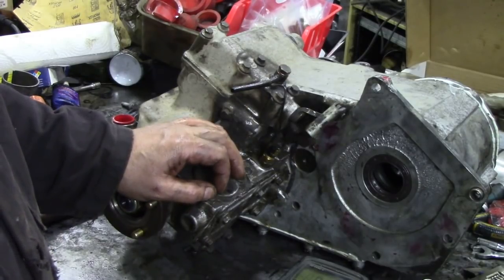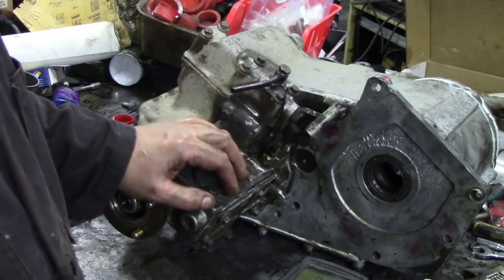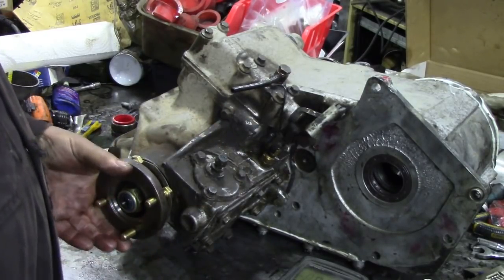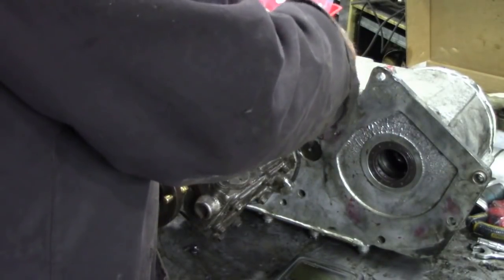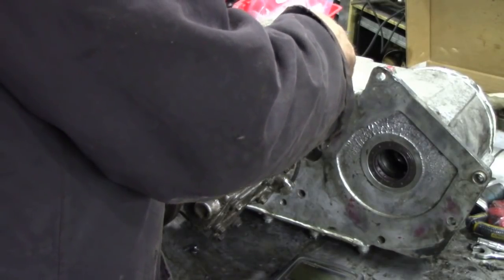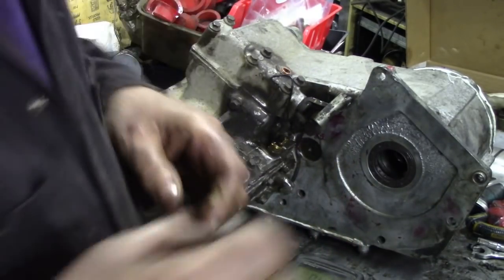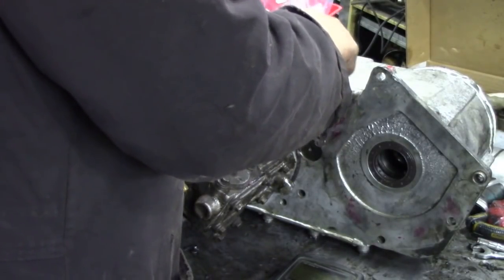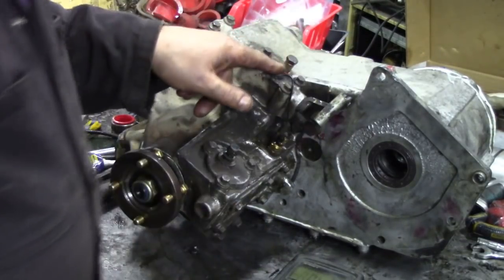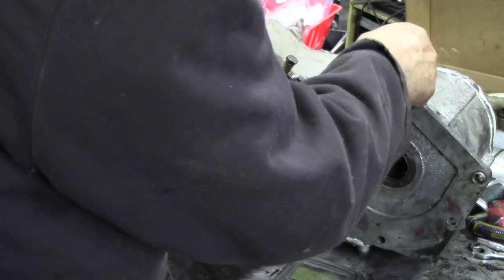You put a small shim in first, work it out with your dial gauge, and then work out the distance plus two thousandths of an inch and you'll be home and dry. That'll be a nice little gearbox. Don't let me forget to take this off here because this is mine. What I do for transport - I get a piece of plastic tube and put it over there, and that can screw into there. Then you've got your plug - you can see quite clearly you've got new copper washers on there without damaging them.